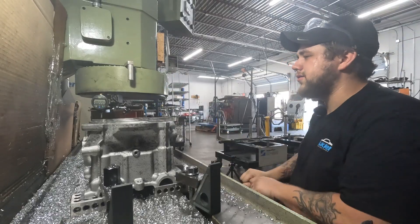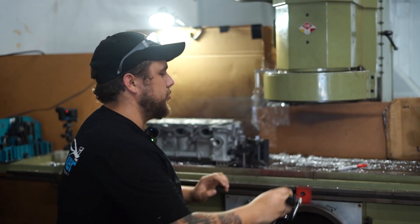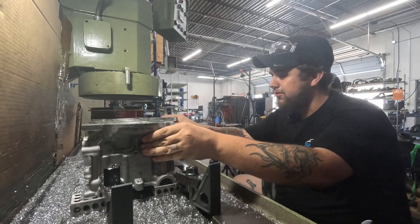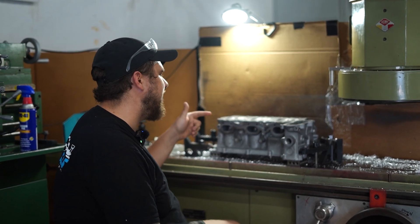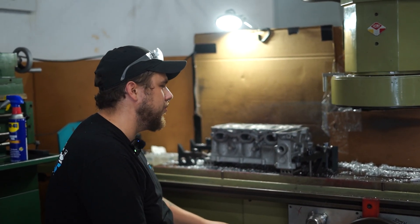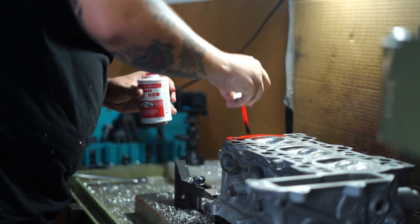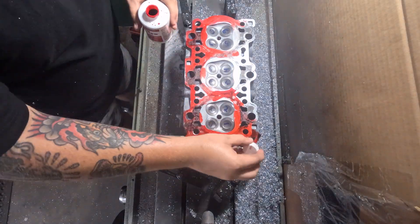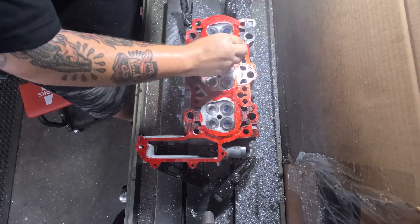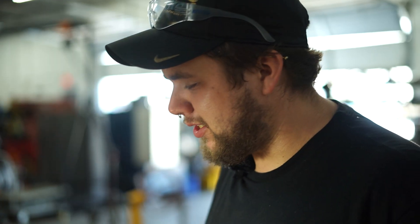When we start cutting, you'll be able to see those spots way under that are affected by the corrosion. Last thing after your setup is to just give it a little wiggle and make sure nothing's loose. Everything's good — now it'd be time to touch it off. I'm going to go ahead and paint some Dykem on here to make the contrast a little easier for the camera, and then we'll make some chips. I'm going to let this dry because the air coming off the cutter will just blow it away if it's wet — it'll be like wiping it off almost.